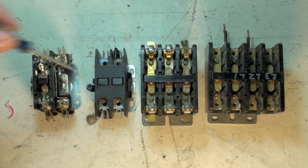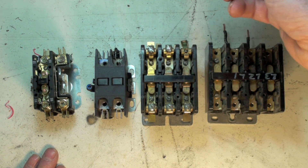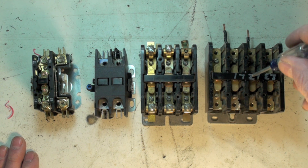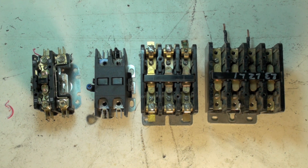This is a double pole — also probably a 240 volt contactor. Just has two poles. Three pole is going to be for three phase. You can do two pole with three phase, but it's similar to the single pole in that you still have power to the circuit when you're finished. Here's a four pole. Because we don't have four phase, it's usually some sort of auxiliary contact that may run a 120 or possibly a 240 volt circuit independent of the prime mover. Those are the different configurations you might see in this industry.